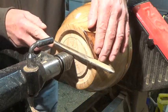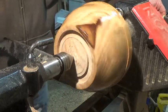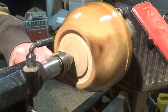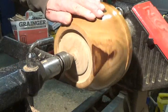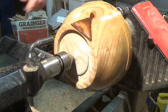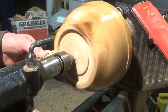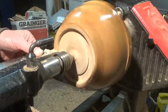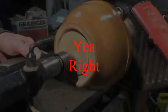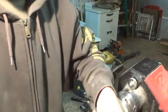We got her flipped around. I'm pretty happy with the finish so far. This tenon is already below the lip, so just in case I went too deep I'm going to leave it on there but clean it up and make it look nice — just nibble away at it. I'm going to scrape that bottom a little bit and get that cleaned up. That should be good enough — yep, much better. All right, I'm going to pop this off, sand up the bottom, sign it, and get a finish on it.